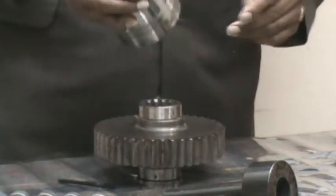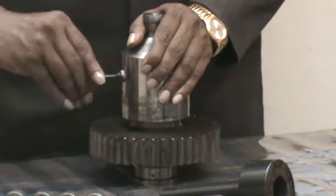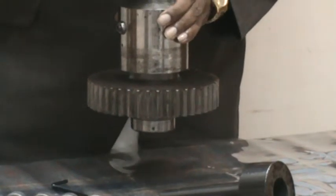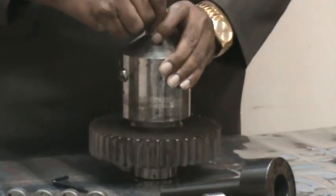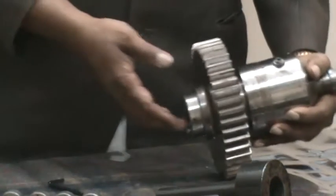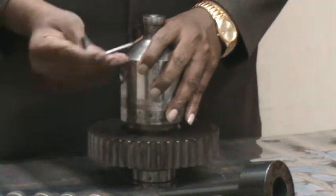The component and mandrel are free — not yet clamped. With one clockwise turn the component is locked and clamped to the mandrel; they are inseparable. Up to 5.5 kg per centimeter square clamping force acts on it, spread uniformly. Even after clamping, concentricity is maintained within 5 microns for the component, transferring the same accuracy after profile grinding or whatever grinding operations are performed.